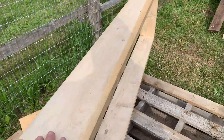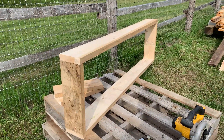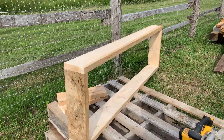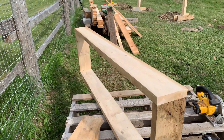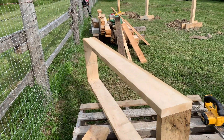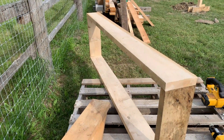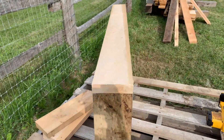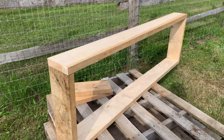While we wait for the post and rack for the solar panel, I'm going to start working on our battery bank box. I'm building a two-by-six frame for the base. The batteries we have are six-volt, 445 amp-hour Rolls batteries and we have eight of them, so I want to make sure the base will withstand about 800 to almost 900 pounds. Once I'm done with the floor I'm going to build up the two-by-four walls. Everything is going to get insulated and water-sealed tight.